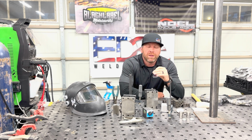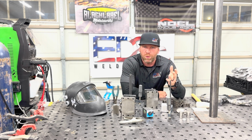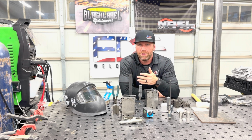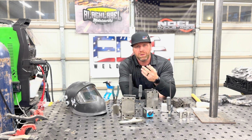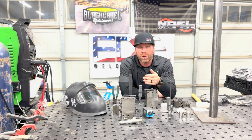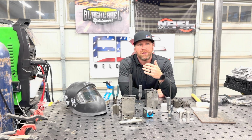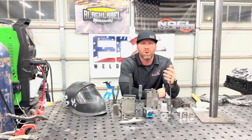Everybody knows that TIG welding has hundreds of variables. There are too many to talk about. We can go into the machine you bought, if it's working properly, the torch you've got, the collet body or the gas lens that you're using, the cup size, the argon or whatever you're choosing to use on this weld, the CFH that you're using, the atmosphere, whether you have wind or moving air or whatever.